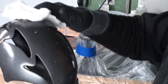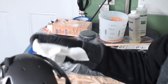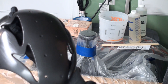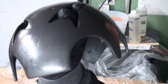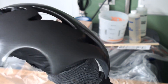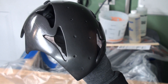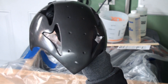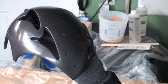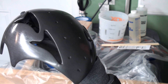I'm just hitting this really quick with some acetone. This stuff evaporates quickly and it's a good prep for the surface. Anytime you sand, you're going to leave debris behind — that's what a tack cloth usually handles. But in this case, the instructions actually recommend that if you're using polyurethane or acrylic beforehand, you should definitely sand it and hit it with some acetone. So we've got a good surface here for bonding. Next step is to pour.